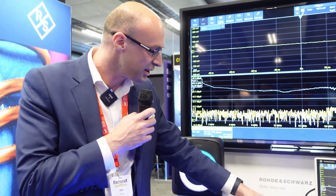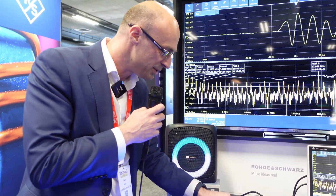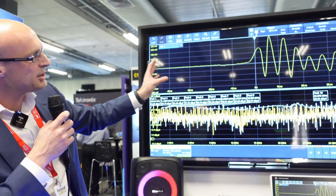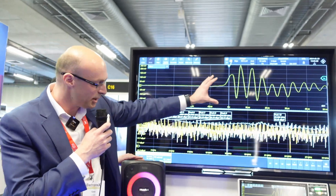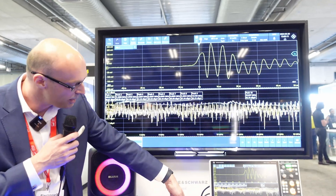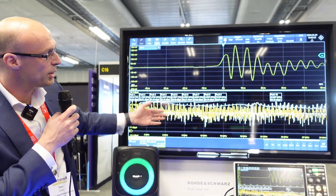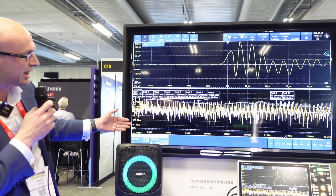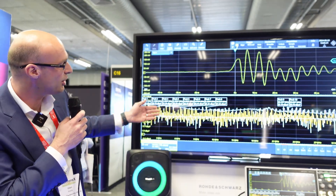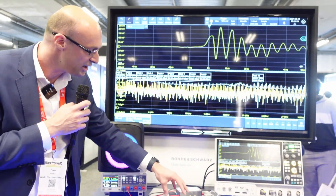We'll start off with our bad design. I'll switch on the power supply and set the load to draw 420 milliamps. What we can now see on the screen is in the time domain we're measuring the noise being conducted through the power supply into the LISN, extracted off channel A, and also in the frequency domain. Looking at conducted emissions from nine kilohertz to 30 megahertz, as a design engineer I've got all these harmonic noise running through — this is basically my noise source.